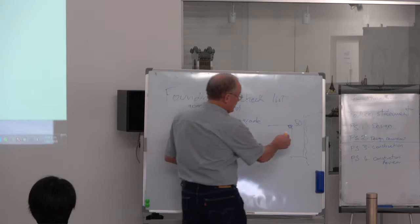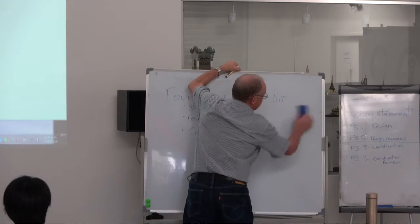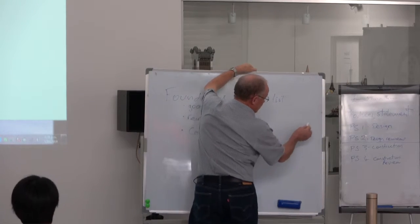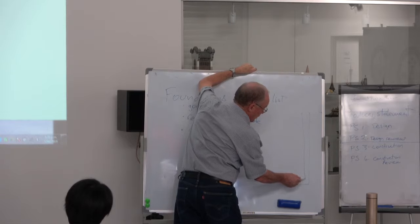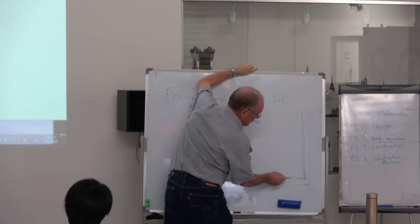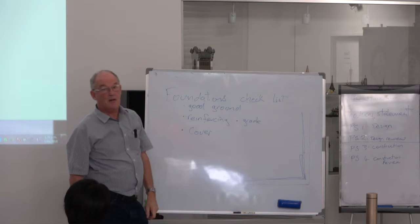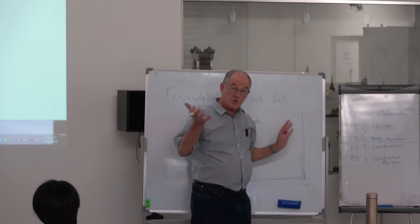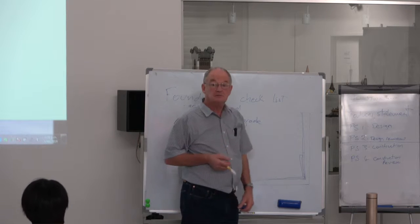He will check, for instance, when you've got the reinforcing bars going around, and all these measurements will be shown on your plans. Where you've got the corner and the steel's coming along there, and these rods are all going along, and they've got the correct bend, and this one comes along and is bent that way. That lap is a minimum requirement. It's 40 times the diameter, 40 12s if it's a 12mm rod, 480. We're looking for the bend, or the cover.